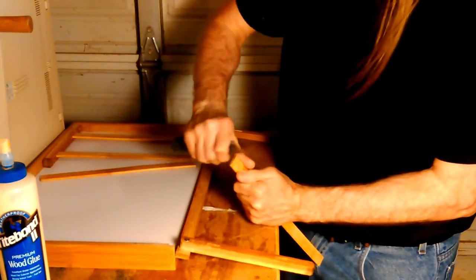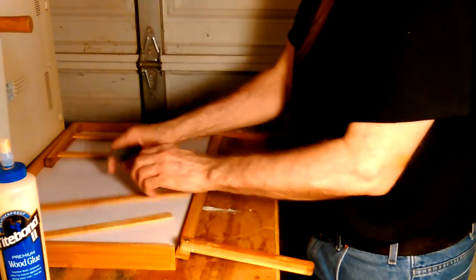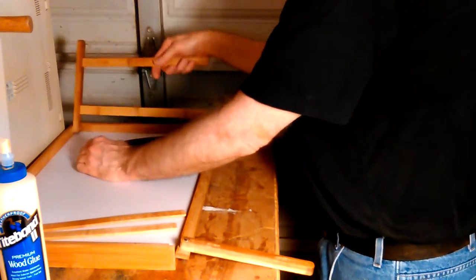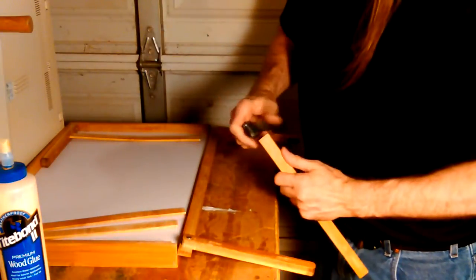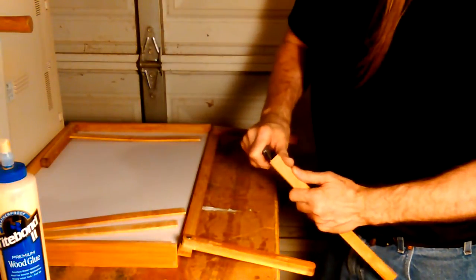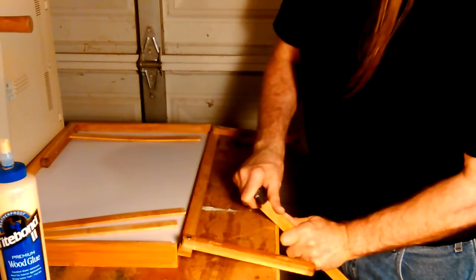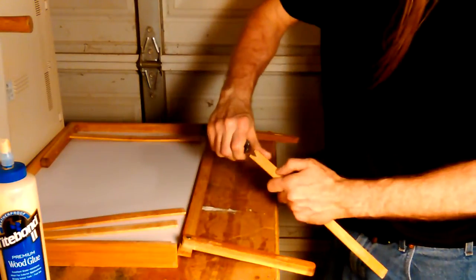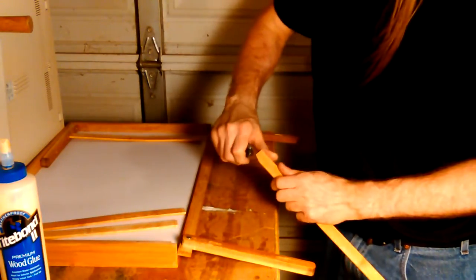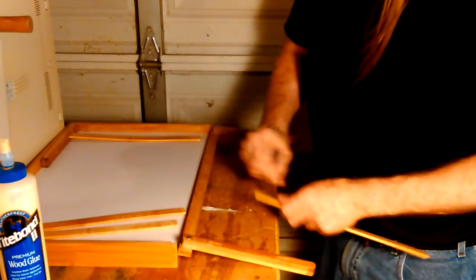And then I'm kind of scraping the edge down deep and chamfering the edge just a tad so that it goes in there good. These hinges are put on with rivets, not nuts and bolts. But you might think, oh, that's good, they won't come loose. But what's bad about them is you can't tighten them as the thing wears. So the legs swing in the breeze, and it's real prone.